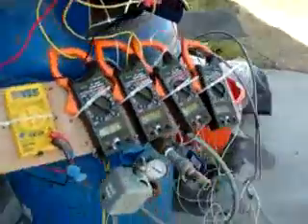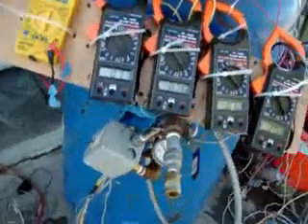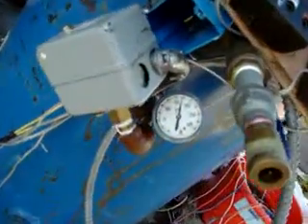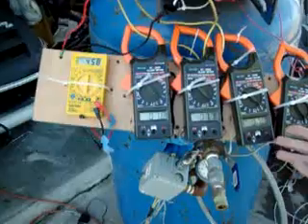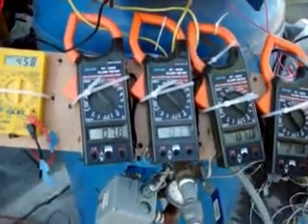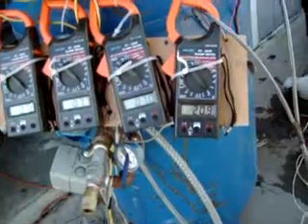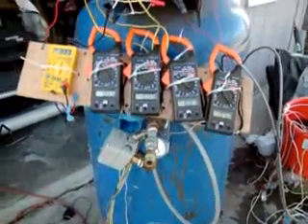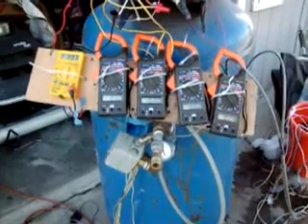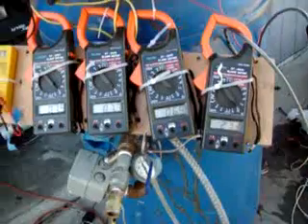Right now, let's look at the pressure here — we've got about 175 pounds of pressure. And you can see it's 7, 8, 7, 7, 7, 0 — 21 amps now input. You don't hear the air bleed out because I got that disconnected, and it starts right up again and runs away.